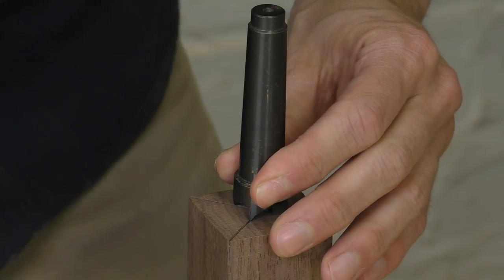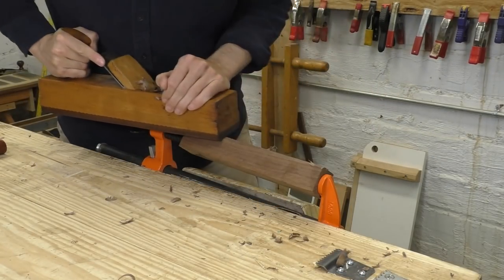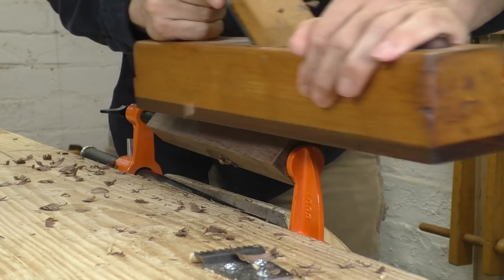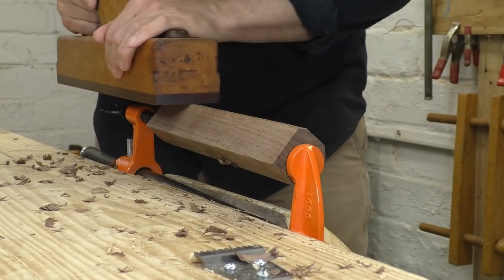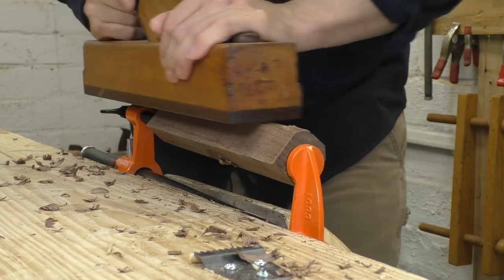For the other end just find center. You can take square wood straight to the lathe, but spindle turning is easier if you knock off the corners first. I'm using a heavy set hand plane, but lots of people do this on the table saw which is quick and saves you time at the lathe.